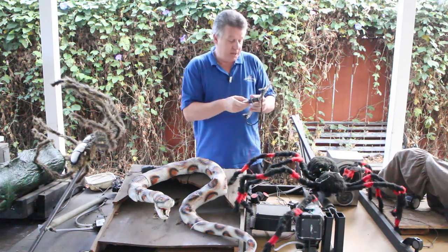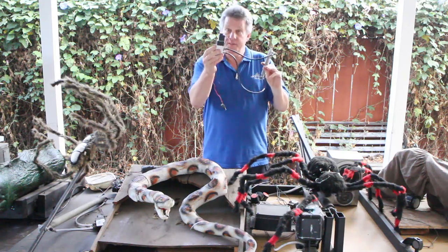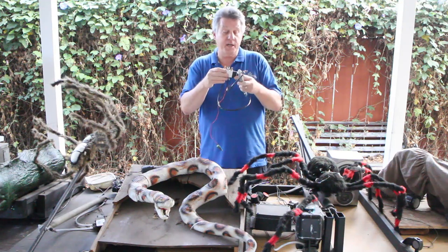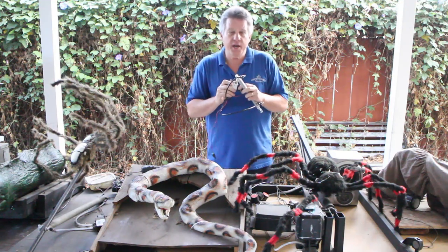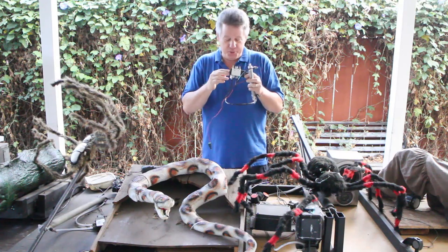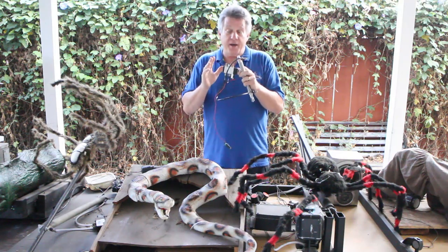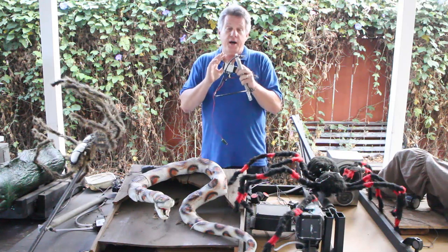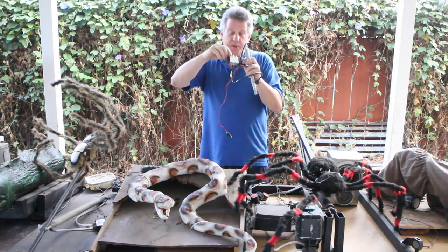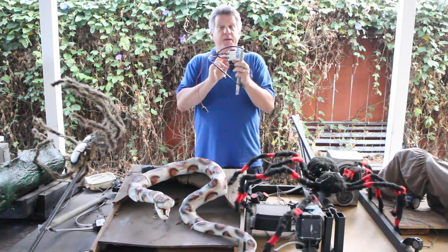That pressure gauge is going to go up into your next component — each of your props is going to have its own solenoid. I like to standardize all my parts as much as possible, and I do that with the solenoids and with the fittings. One little warning here: you can get U.S. parts made in the U.S.A., which is what I prefer to use, or you can get these less expensively overseas. Those solenoids and cylinders do work; however, the made in the U.S.A. parts use NPT threads, and the overseas solenoids and cylinders use BSPT threads — they are not interchangeable.